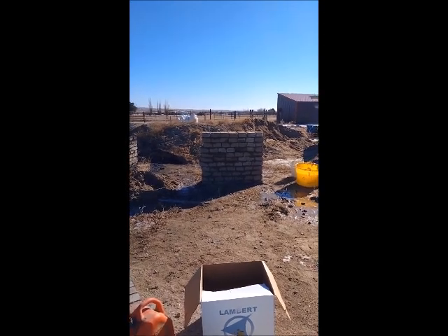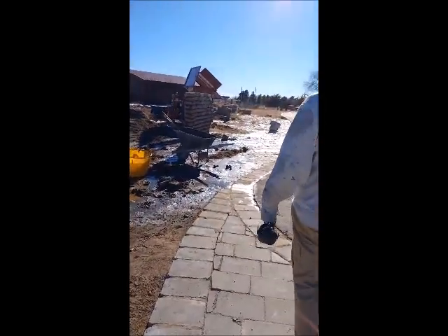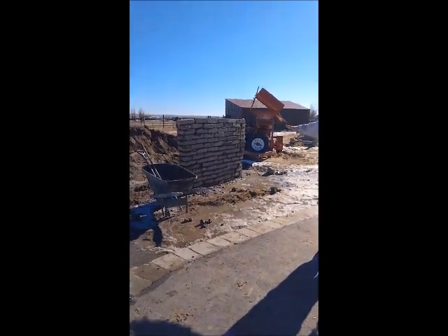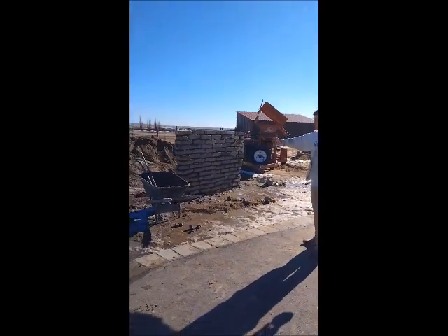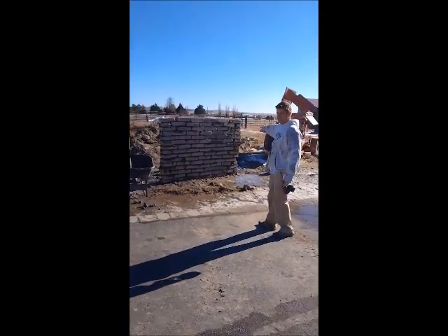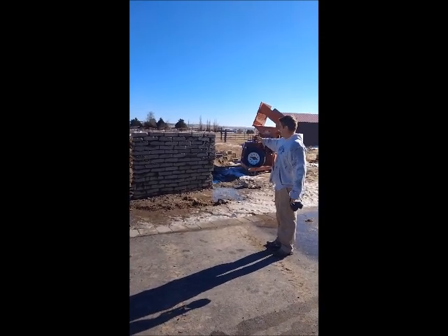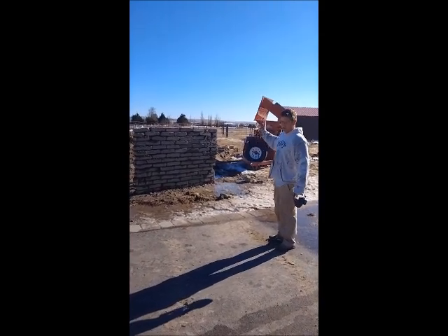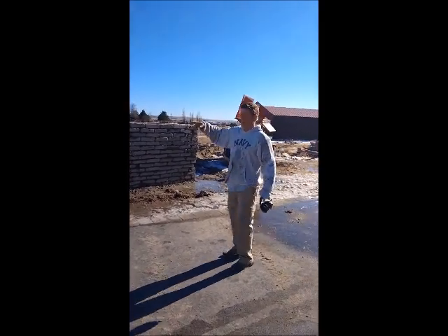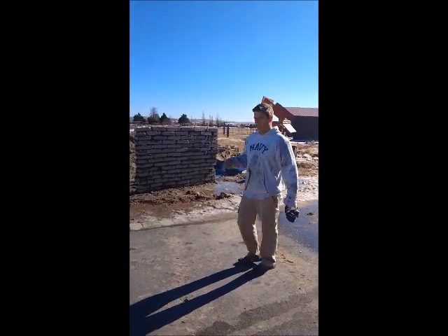It's what we made the earthen mortar out of — it's just mud, just dirt blocks joined together with mud. Then we're going to move on to this wall which looks a little precarious, but the left side is actually 8-inch thick cement-stabilized, 8% cement stabilized. The right side is 7-inch thick only and it's unstabilized. That'll be the thinnest wall we've ever shot. I just want to see: can a 7-inch thick wall stop a bullet? We're going to do all this from about 40 feet distance, and we're going to do a pretty big rifle at the end — a 7 millimeter. Stick with us.